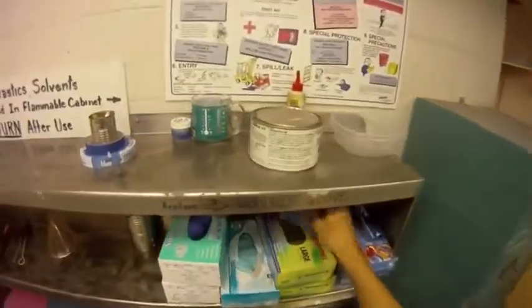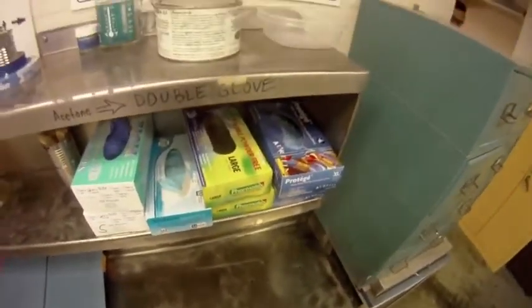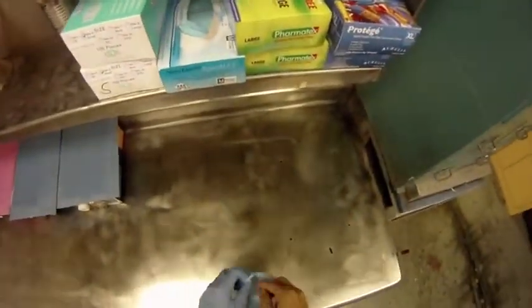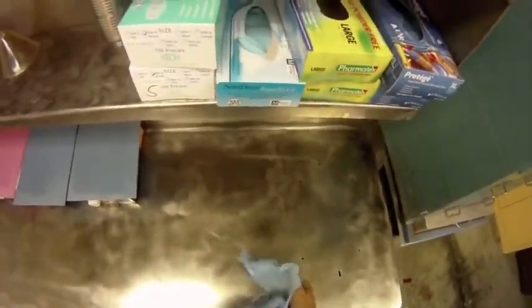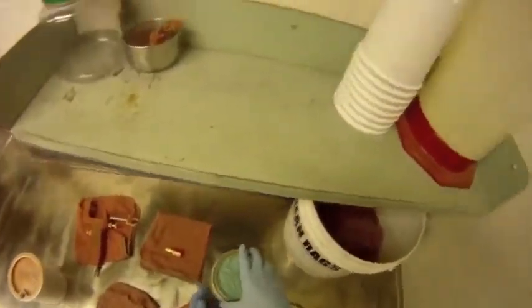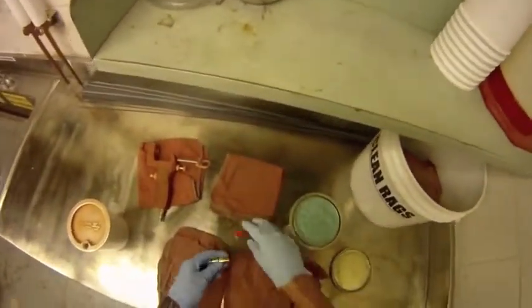Before setting up the gun, put on the proper size of nitrile latex gloves. Then, locate the can of wax for waxing the nozzle of the gun. Thoroughly wax the nozzle of the gun by using a rag and dipping the rag into the wax and applying for an X amount of seconds. The reason for waxing the nozzle is because it will prevent seizing of the threads.